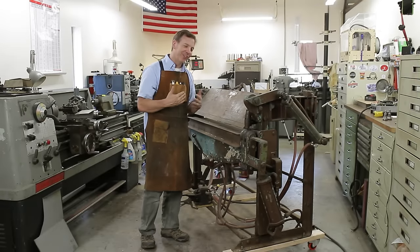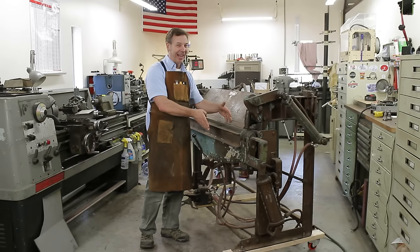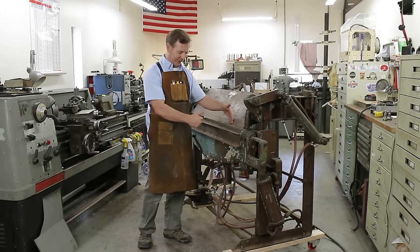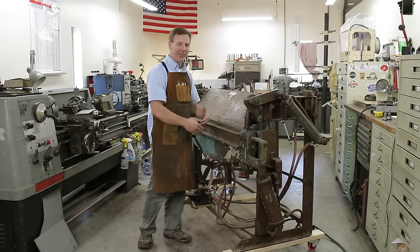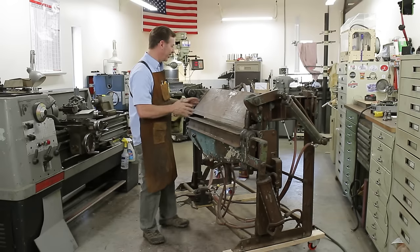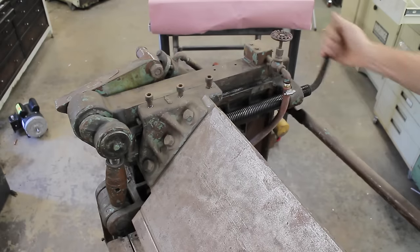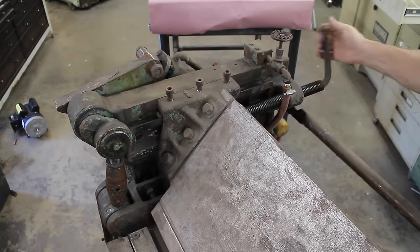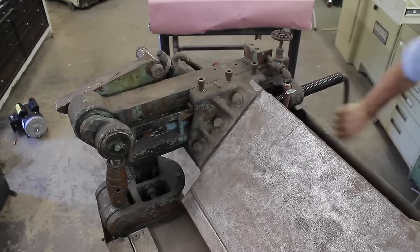Now, what is also interesting is the fingers on it are around 6 inches. I think I could actually squeak it out to 8 inches. And you guys are going, well, if you were to put a finger on there that sticks out 6 inches or 8 inches, well, your bending point, you're missing the whole bending point. Well, that's what makes this a very unique machine, because this whole beam, upper beam, has a set of screws on it, and it pushes back up to 8 inches. Now, the scale says 6. I've moved it to 7. And there was still another inch left over.